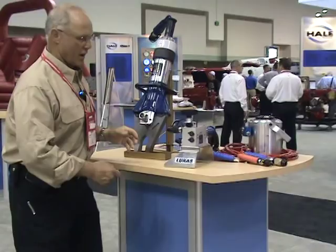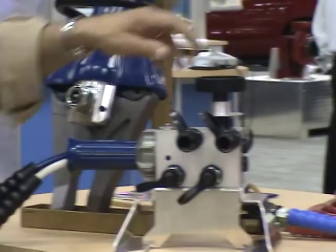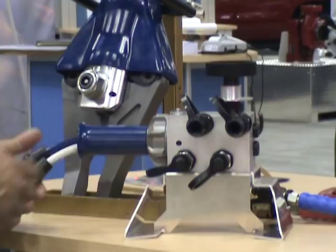Next to this is our hydraulic jack system. This is our MSM valve, which controls the operation of the hydraulic jacks. This is our direction control to raise or lower, and this is our speed control. One circuit off one power unit can operate two jacks.